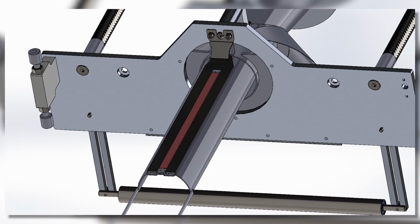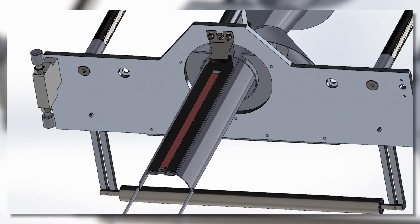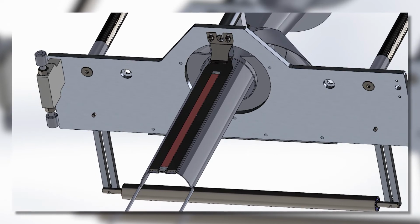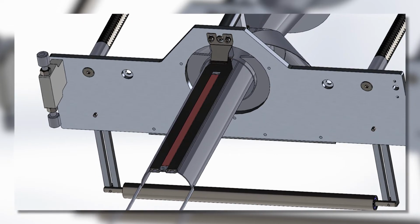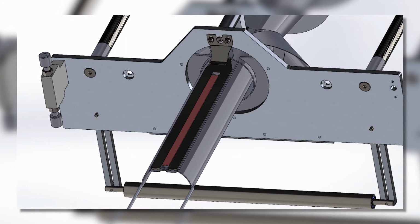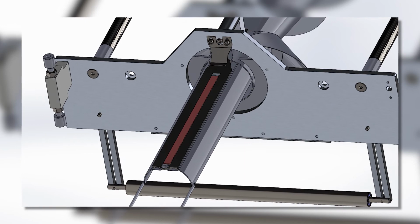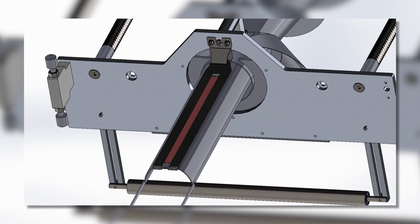At Kenray, we've developed many variants of the TNA back seal to ensure proper sealing, particularly with matte and paper film. In the example shown, the PTFE is replaced by stainless steel, which also assists in keeping the tube stable. The insert in the centre can be replaced with different materials to seal different films.